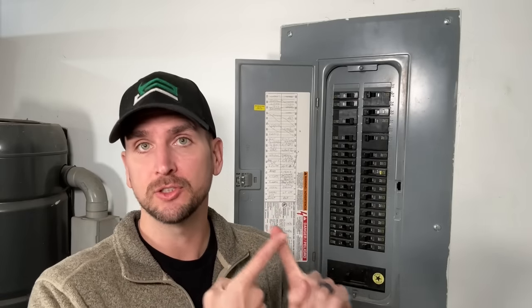This could be because you have a failed circuit breaker — it keeps doing nuisance trips on you and you just want to try a new breaker to see if those go away. Number two, possibly you're installing a new circuit and need to install a new breaker. Or number three, like my instance, you might have a couple of circuit breakers that you want to move.